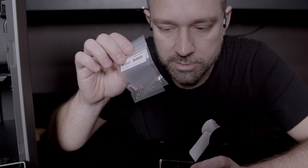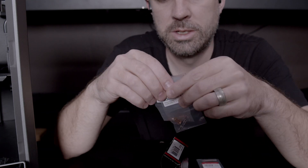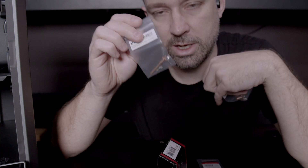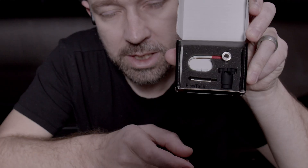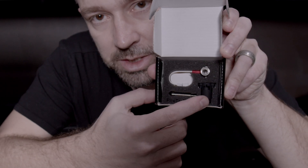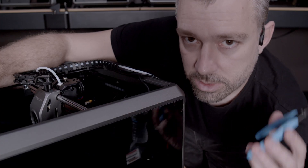Let's open it up and see what we're dealing with. Right off the bat we have our instructions, and then we have two inserts for the heat sink. The two inserts: one is for the older style K1 series machines, and this is the longer one for the unicorn nozzle style heat sinks for the K1C and upgraded Max. Lastly we have our hot end, a 0.4 millimeter nozzle, and the silicone sock that goes over the hot end.